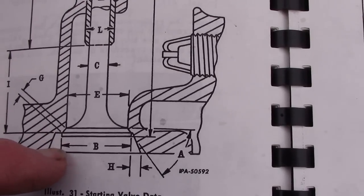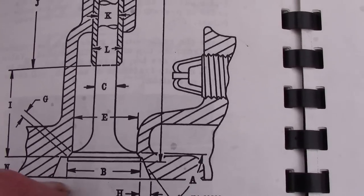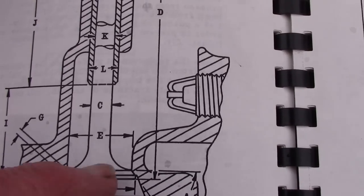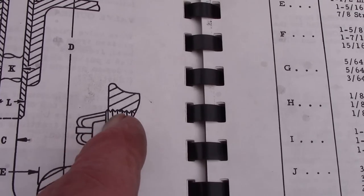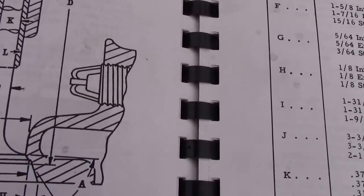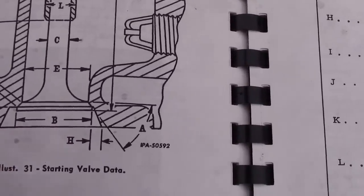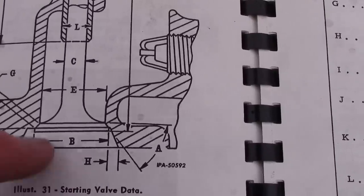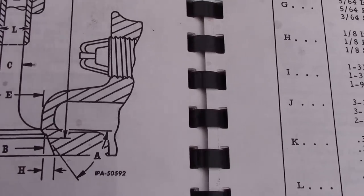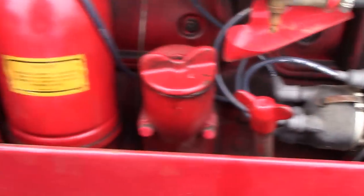Pushes that valve down right about that line, no lower, because the piston's going to be coming up for the diesel. And when you're starting on gasoline, that thing comes down, gasoline comes in through here, gets into this area, sparks. There's the spark plug. Then when you warm up the engine enough, the piston is warmed up and everything, that whole combustion chamber gets hot. Shut off the gasoline by popping that back up. When you push that handle forward and the spark goes off and the carburetor shuts down, no more gas going in, no more spark. She takes right off.